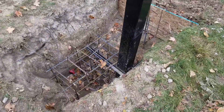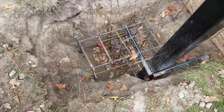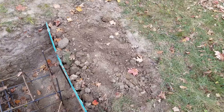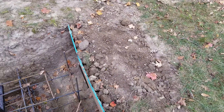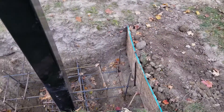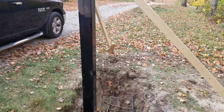Did a little bit more research between last Saturday and today and figured out that the concrete pad we were going to extend behind the column is not necessarily the right location for where the opener base might sit. So we're going to go ahead and fill it in now and we'll pour more concrete later. Just took the leaf blower and blew the leaves out of the bottom as best I could. That rebar cage looks pretty good. We kind of put a piece of plywood in there and backfilled. There's no need to pour concrete out to here if we're not going to have anything sitting here — the openers might ultimately sit out here if we use the pedestal style, or if we use the linear style they'll just affix right to the post itself.